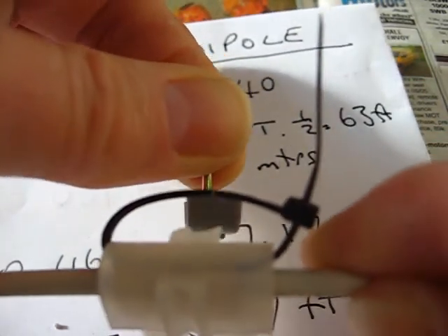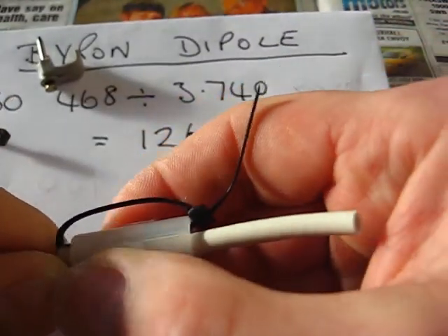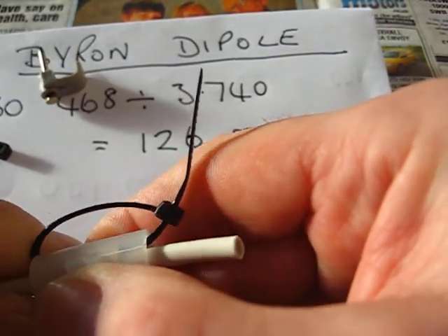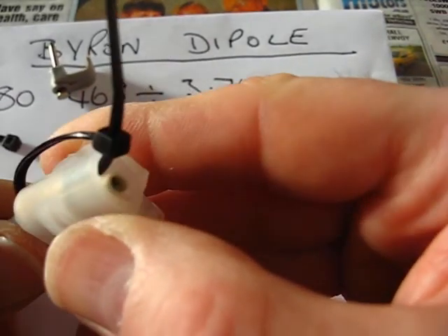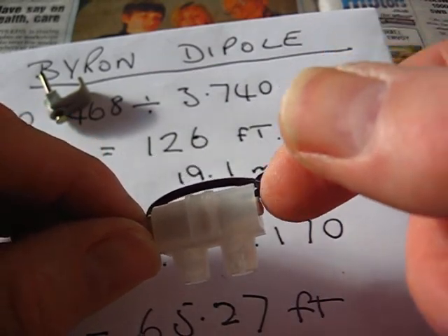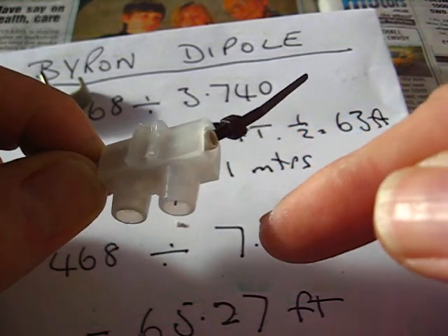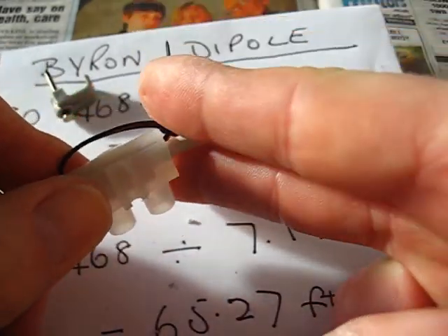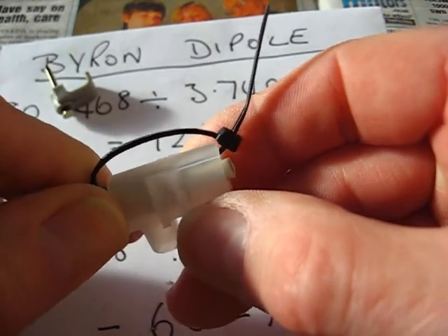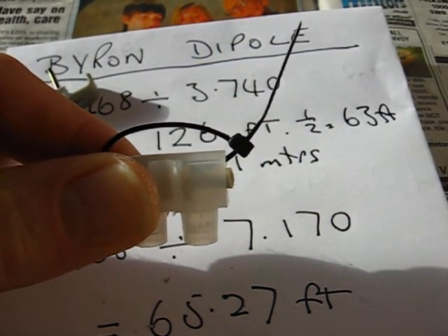Nobody will ever notice it. These do not make any difference whatsoever to SWR — that little bit of steel or brass in there doesn't make any difference. But you don't join the ends together — do not join them ends together. Just pull them tight when you finally finish; you don't need to seal it whatsoever. But at the centre piece, I've joined all the wires together — gives it more strength. At the ends, when you want to trim, you just cut off, measure it with the other one, pull it tight, tighten both of them. And that is strong as anything. Good DX — see you later, bye.